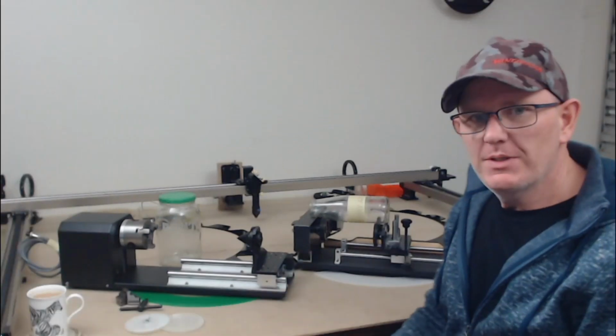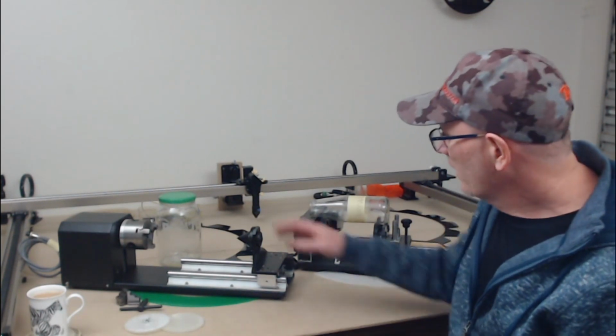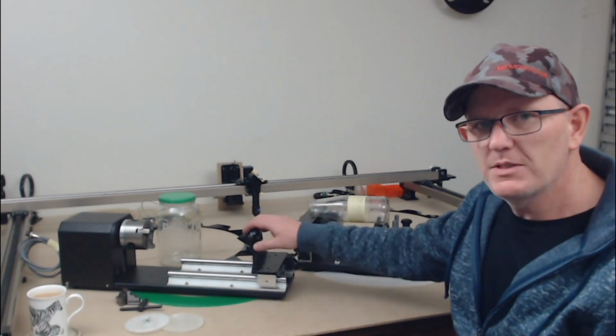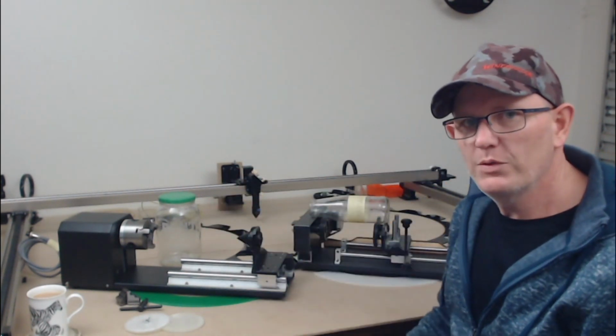So I hope you've enjoyed this rotary axis series that I've put together. I've tried to be as comprehensive as possible. So when it comes to choosing between which rotary axis you want to use on your machine, just bear in mind some of those limitations, whether it be the diameters of the workpiece, the length of the workpiece, and the methods of holding it in place.